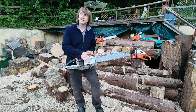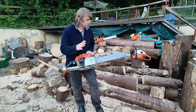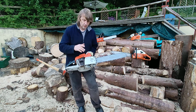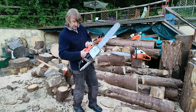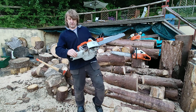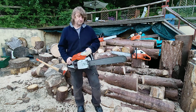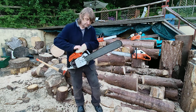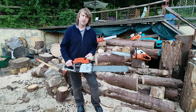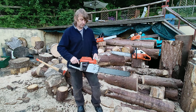It started life, I think, in 67, and Stihl say they can run from a 16 to a 25 inch bar, and it's a fully adjustable chain oiler. Little orange wheel sits under here, and it's a really excellent chain oiler. All mag alloy construction all the way around, even down to this beautifully undamaged mag alloy knuckle guard. Full AV. This one's unchain braked at this time, and on paper makes around 3.7 horsepower, depending on the literature, but somewhere around there.